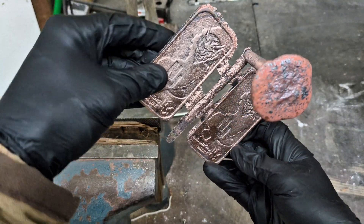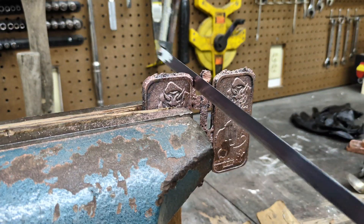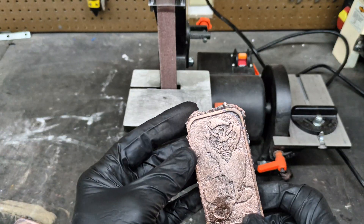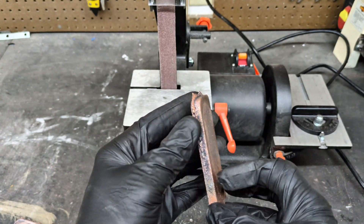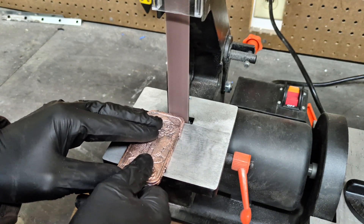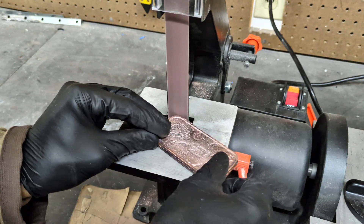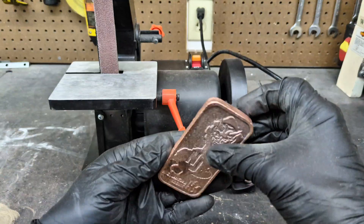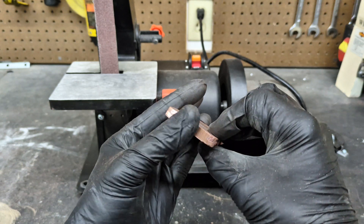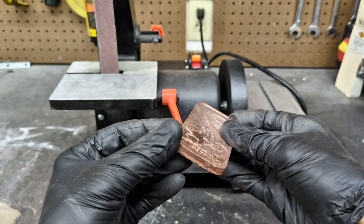So now I'm in the garage. They have cooled down enough for me to cut off the gates and the runners and start cleaning them up and seeing how well they came out. I can already see that they came out better. I just have to sand away the flashing on the edges. Now that the flashing is all cleaned up, it's time to clean up the face, and the face of this bar looks much better than it did with the vertical flask.